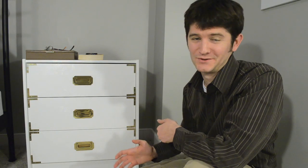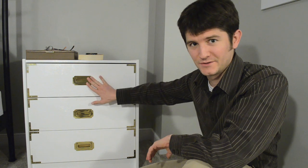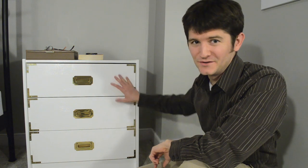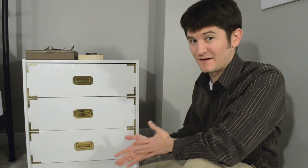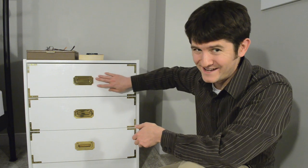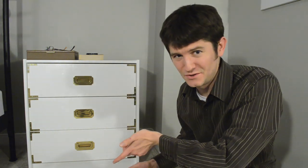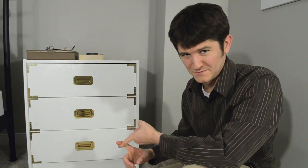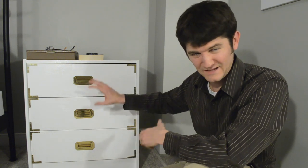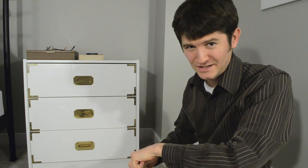The next tip has to do with the drawer pulls. You want to make sure you know what kind of work you're getting yourself into. We ordered campaign chest drawer pulls — these are them here. With campaign drawer pulls, a lot of them require you to recess them into the drawer head, and that can be a problem, especially if you don't have a router, which I didn't. The way we accomplished this was by taking masking tape, putting it on the drawer head, and laying out the design of what needed to be cut on top of the masking tape. The masking tape does two things: it keeps the wood from splitting, and it lets you remove the template after cutting without marking on the drawer head itself. I used a Dremel tool with a high-speed cutter to do the actual cutting.